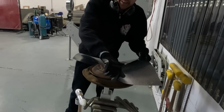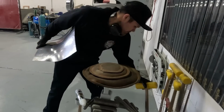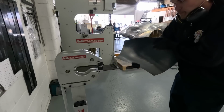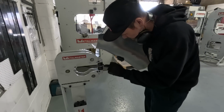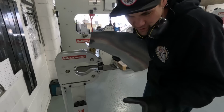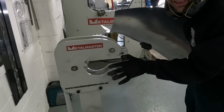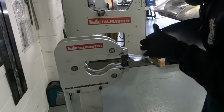I can really see how torqued this is, so I'm gonna go to the shrinker now. This is a round jaw shrinker, and it just means you can kind of get into tighter spots. Me personally at home, I've got the rectangle kind of cheapy ones. These ones, you can imagine how tight of a flange you could potentially get out of it. So it's kind of a nice shrinker.